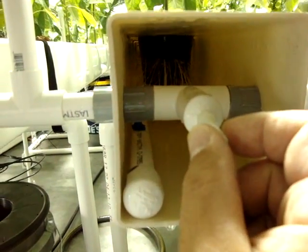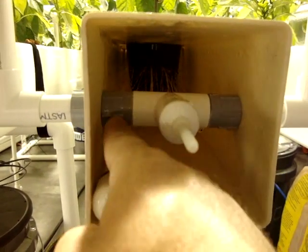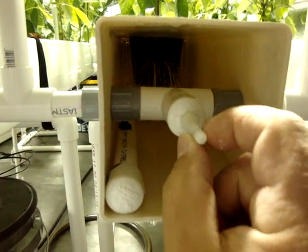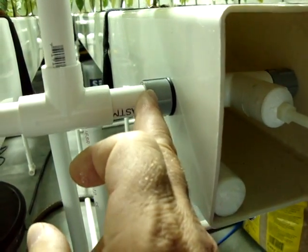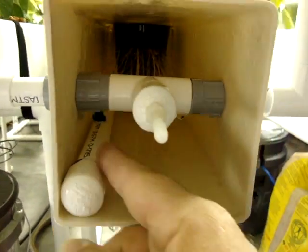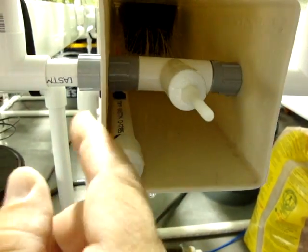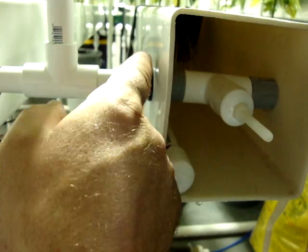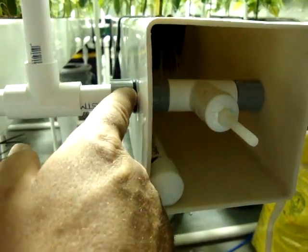The first thing was designing a T piece that could pull even pressure for the gasket. What I came up with is basically a couple of electrical fittings - all half inch to a T, to a cap that I drilled and put in a nylon nut with a nylon bolt. Then it comes out to the male side. There's an O-ring - it tightens up, just screws and tightens up by hand to the female side. I had to cut these female pieces shorter to get that dimension right to fit. The O-ring is just a normal O-ring from a faucet store - I got a pack of 20 for a couple bucks.